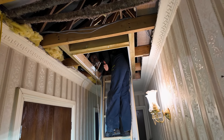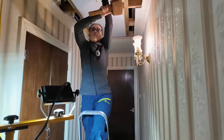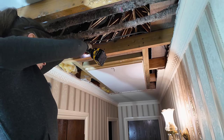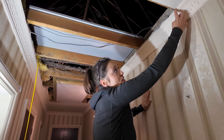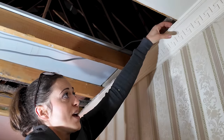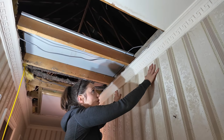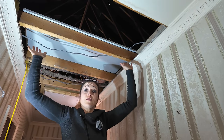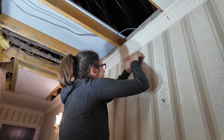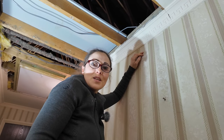I'm happy with this now - I just need to tidy it up. I've recycled a bit of the joist to double the strength of that one and prevent it from bowing. Now we're cutting where the coving is, removing any excess overhang of the old plasterboard, to create a nice clean corner so we can start cutting plasterboard pieces to replace it - and doing the same on the other side.